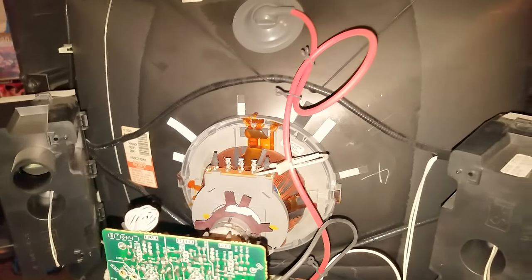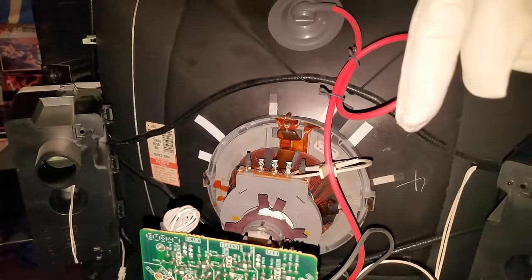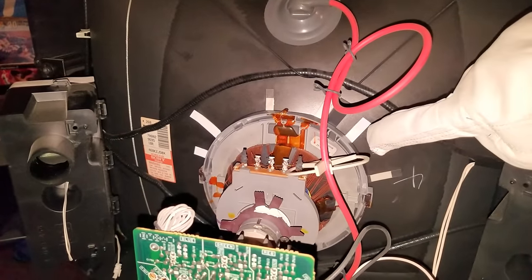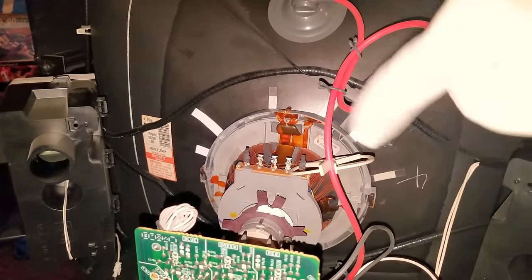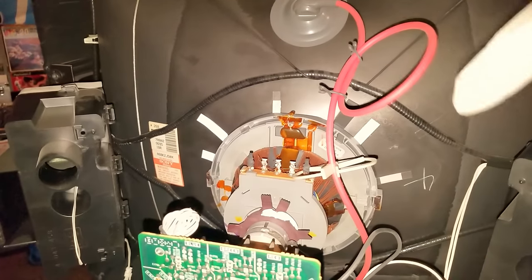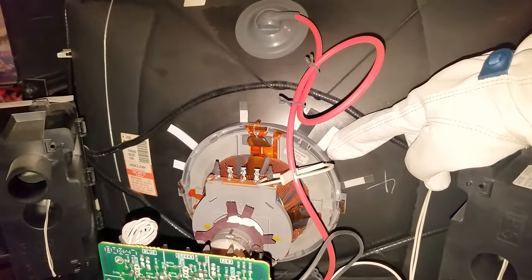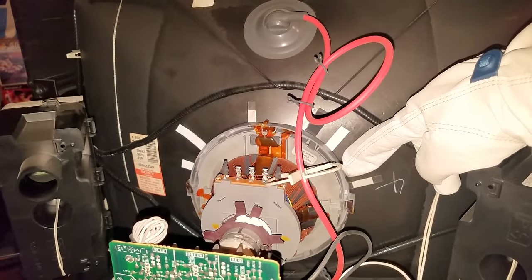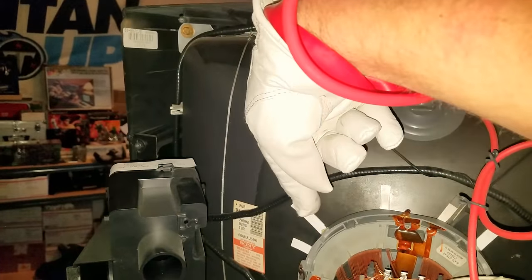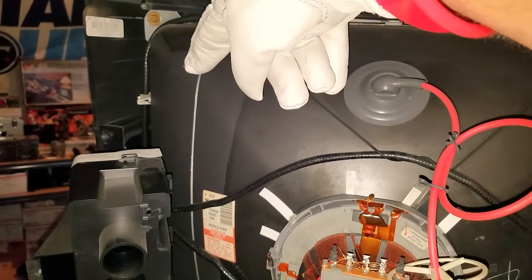Mine cost about eighty dollars. Taking a look at the back of this CRT you can see the convergence strips - there are some already in here. I've already tried some of the newer ones to play around, and there are the older ones. Those affect your corner convergence, so for instance if you want to fix the corner up here you're going to play with these strips or add strips in this area. Today we're looking at this corner because it's the worst, so we're going to be moving around these strips and maybe even adding another one to make sure that corner convergence is set.